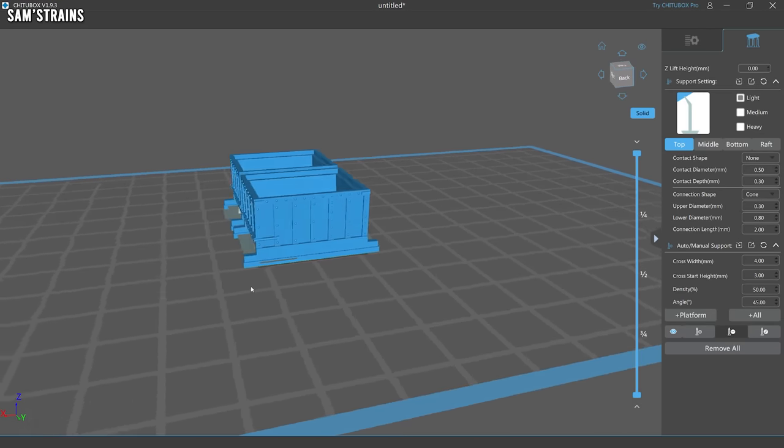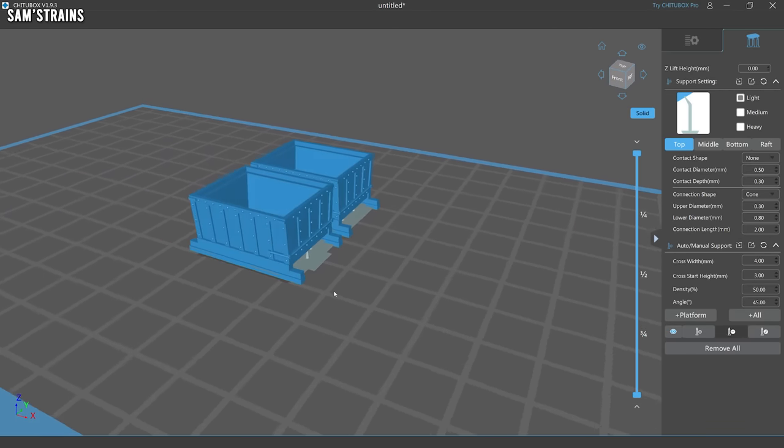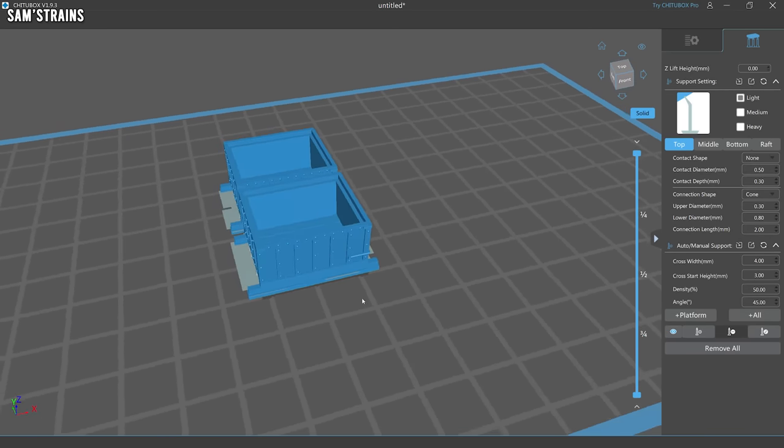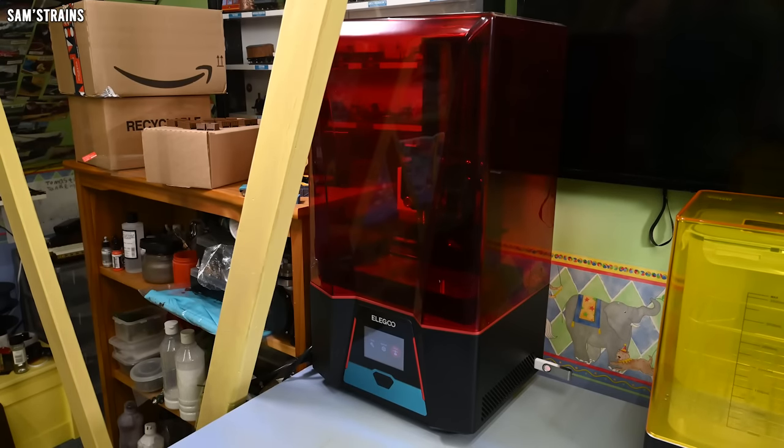I wonder if I should have left these to dry a little bit longer because there's some sort of weird damage around the bottom — I guess that could have happened when I separated it from the build plate. I'll let things thoroughly dry before curing next time. Apart from that though, it looks absolutely fantastic. These little steps inside look incredibly fine, and this twisting spiral up the center would not have been possible with FDM printing at least not at this kind of scale. So that fills me with excitement and hope in terms of what's possible. Now I think I'm going to load one of my own files onto a USB drive.